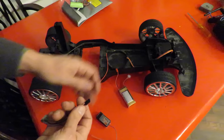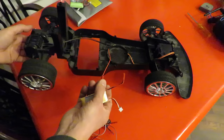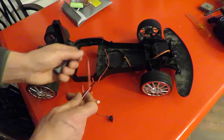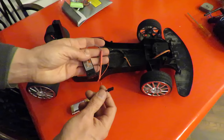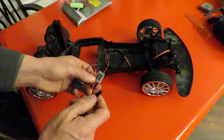This one will only plug into the battery. If you wanted to be silly you could plug the battery straight into the motor and the motor will run full speed, but you've got no speed control over it. This plug goes into the receiver and it also supplies the battery power needed to run the receiver. There's circuitry on the ESC that converts whatever your battery power is to the right power for the receiver. So this ESC has a BEC — battery eliminator circuit — included in it.